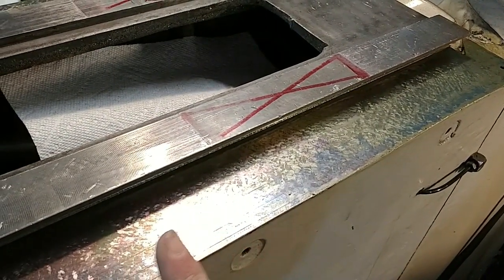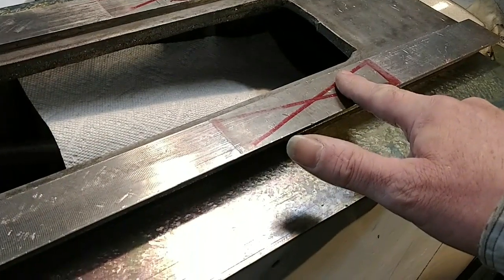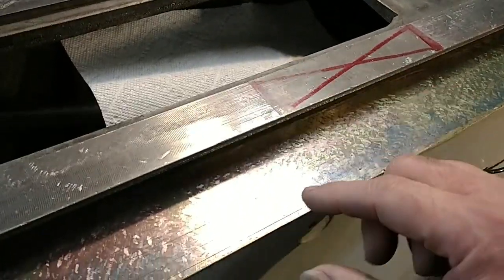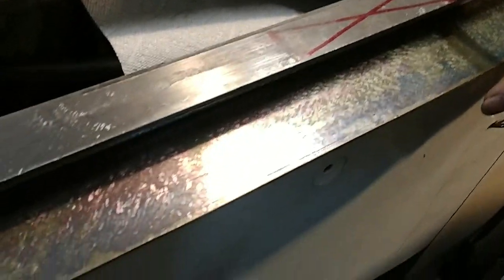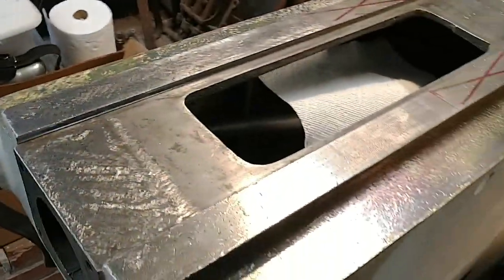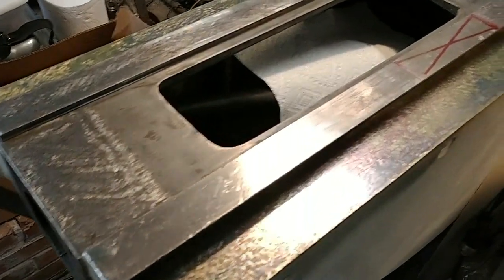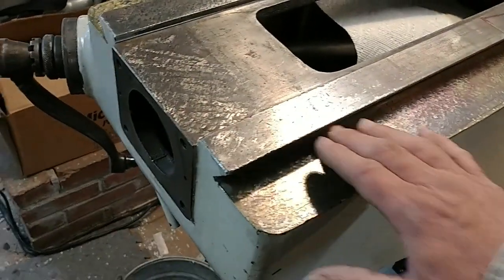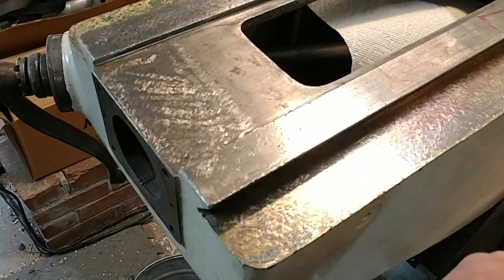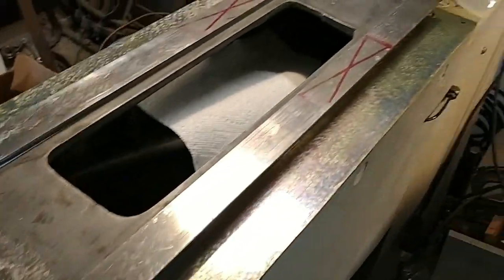But if I use this method, it tells me it's flat. And when I put the saddle up on here and it gives me a nice big red area telling me it's nice and flat and parallel to that side - I'm not getting contradictory readings, but I'm getting confusing readings. I'm getting information that indicates I'm high in here, and I've got to take that down to get the saddle to transfer red to this area without changing the height. I just need to tip this in a little bit. So that's what we're going to do.